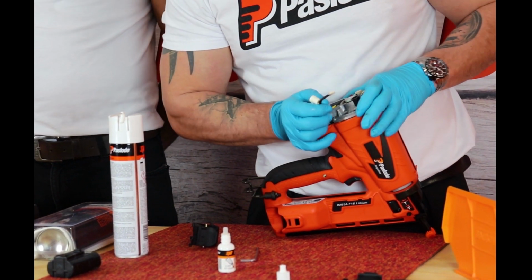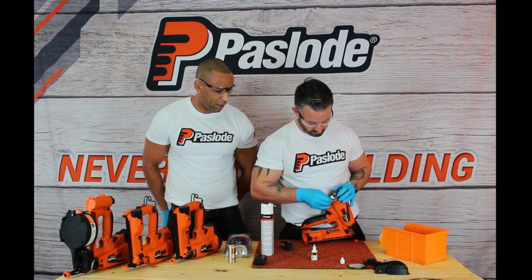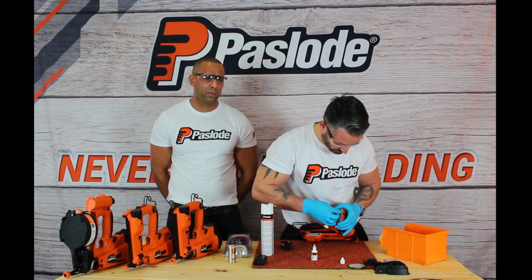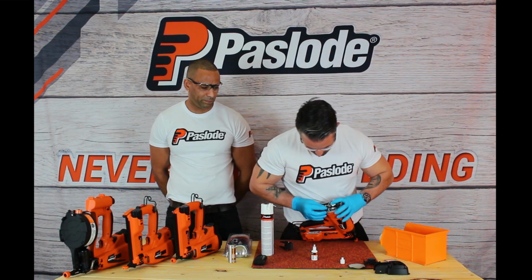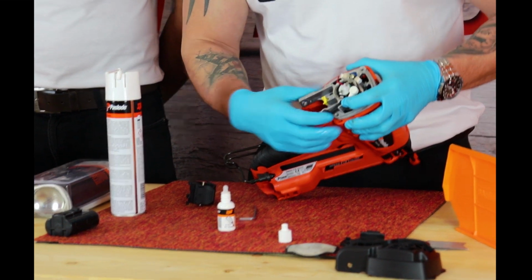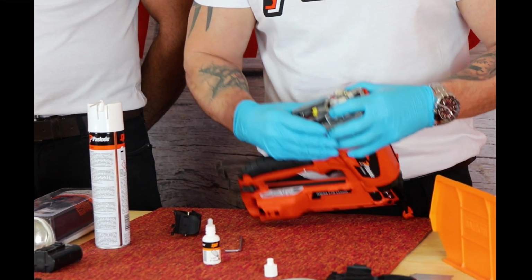In part of that recess, there is a preferred sequence of order to put the cables back in. So you want to be looking to apply the fan cable first, as Danny's doing, followed by the spark unit cable. Make sure they're nicely tucked away in there. If you put the top cap on and they're not in the correct position, the cables may pinch.